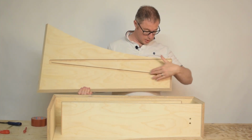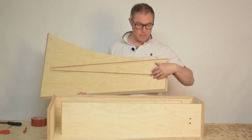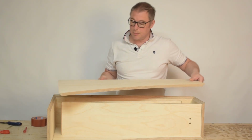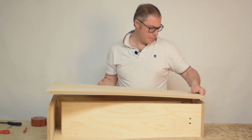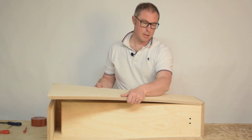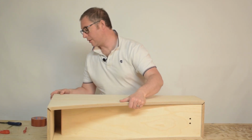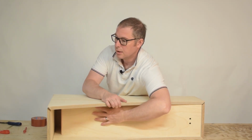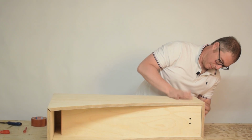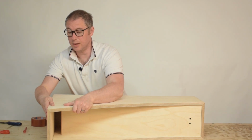which is the mirror image of the other side, again with the mitres cut into it, and those mitres obviously sit, the rebates sit straight onto the side of those boards there, so it becomes self-jigging essentially. So this can be a little bit of a fiddle. I normally start with the top end because I can get this mitre, this rebate set up nicely, and just drop that down onto there like that. Now when you've got this facing towards you, you'll obviously be able to see where these rebates are a little better, whereas I'm having to feel it. Luckily I've made a few, so that's fine.